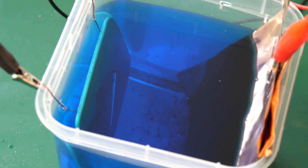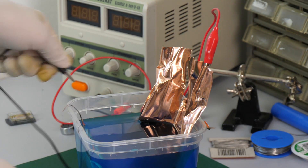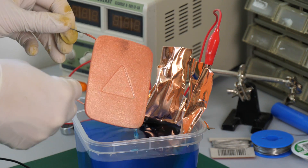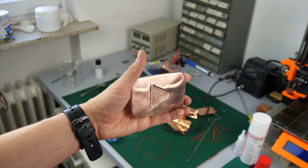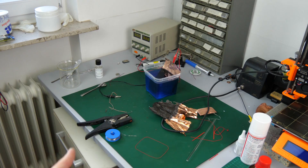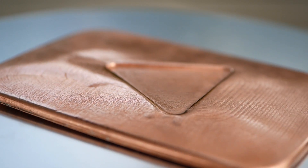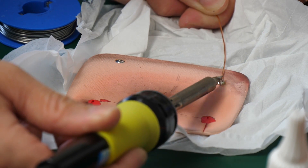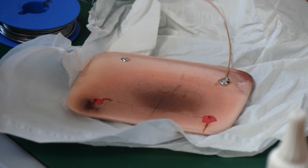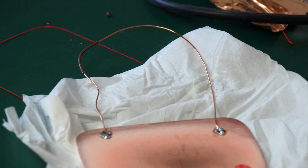Unfortunately the play button did not come out perfect and still showed some matte parts on the lower side — I guessed that bubbles gathered there and ruined the surface finish. I took the part out of the bath, rinsed it, used some very fine sandpaper to smooth the rough areas, and then started polishing. Unfortunately I think I was a little too thorough and the material got too warm, so the copper film started to release in some areas. Well, if you don't look too closely you probably won't even notice it. This technique can actually not only be used for a nice look — it can also serve a technical purpose. You can use it to 3D print complex antennas or shield sensitive electronics. You can even use it to strengthen and stiffen your part because copper is around 50 times stiffer than typical plastics, so even a thin layer will make your part way stronger.